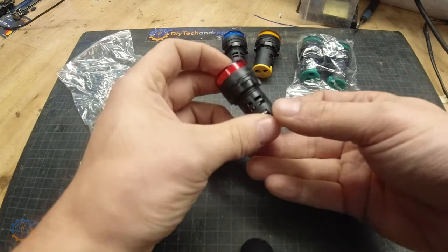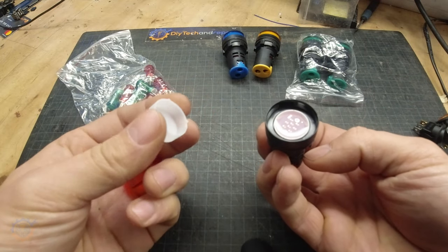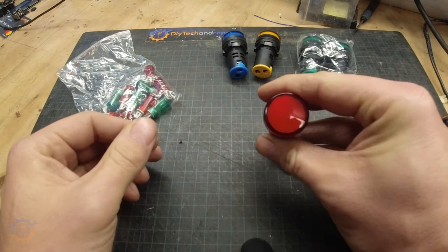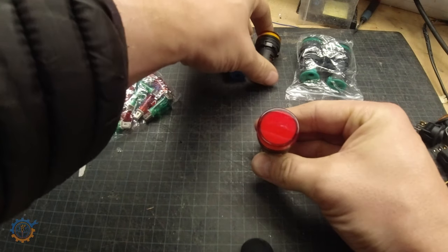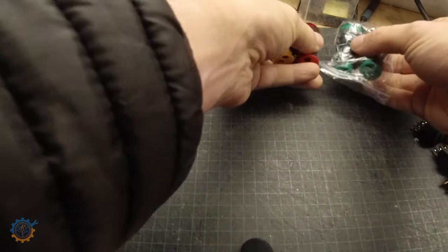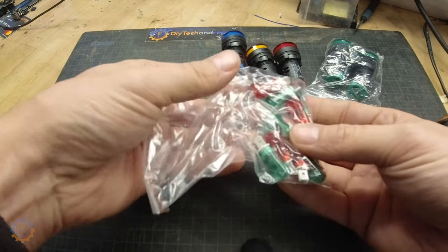Indication is also very important. I bought tons of these simple LED indicator lights. You can pick them apart and inside you can see the LED that does the work. This case here is 220 volt, so I'm going to use them as indicator lights outside on the building showing the state of my heating system — whether it's charging, needs wood, or is in idle state. I recommend having a couple laying around. Smaller ones for boxes are also here — normal 220 volt lights — and they work really well too.